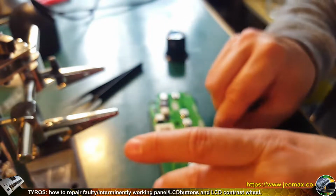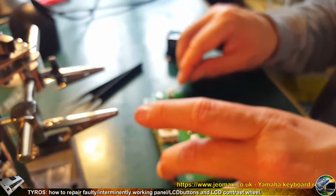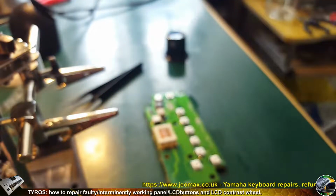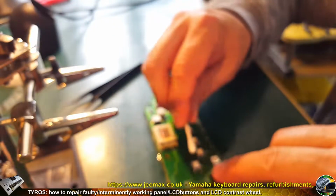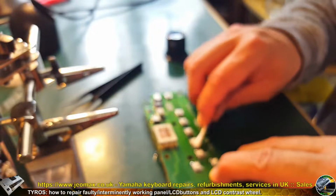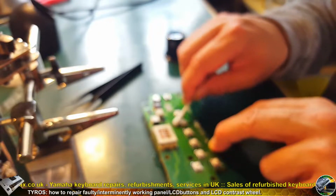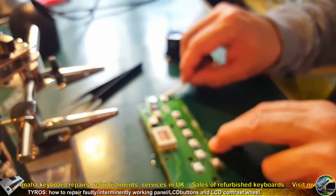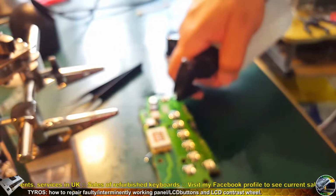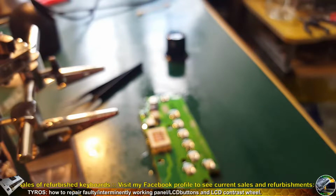So what was happening? It is how the switch is built and how soldering works. A microswitch consists of two small metal terminals inside, which are joined when you press a button, and then current flows. The button works as supposed. When you solder the switch to the PCB, flux heated up by the soldering tip goes over all hot metal elements, allowing soldering. So it goes inside the switch to these small terminals and evaporates in a second. Evaporated flux leaves some residue, which alcohol must dissolve to make the button work, so that's why you must use a generous amount of alcohol. I recommend you sprinkle alcohol and leave it for 15 minutes for dissolving. After that, you may clean it with cotton buds.